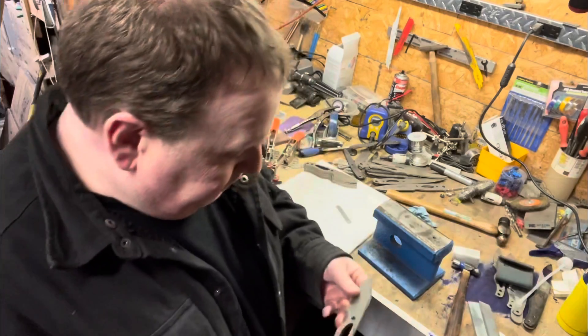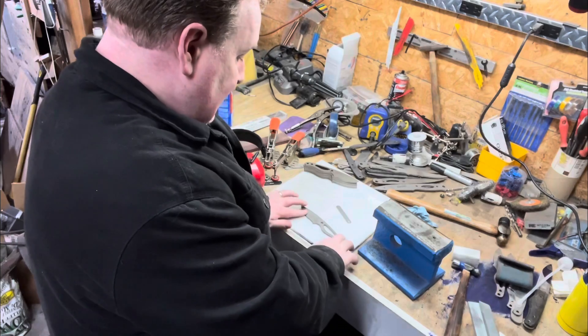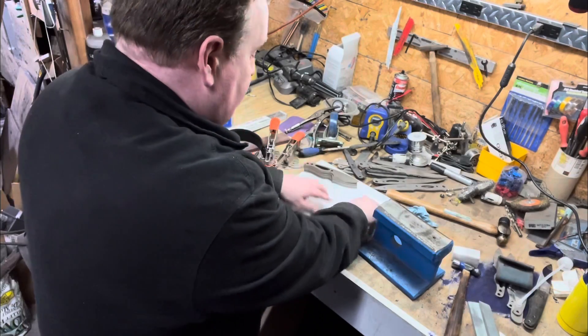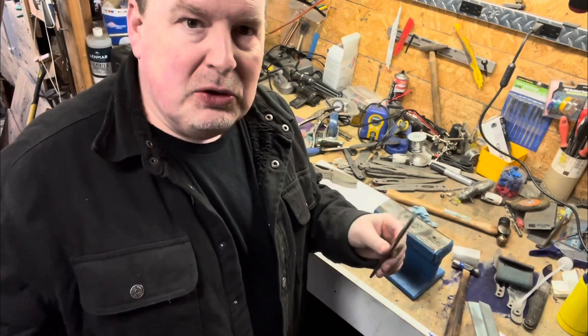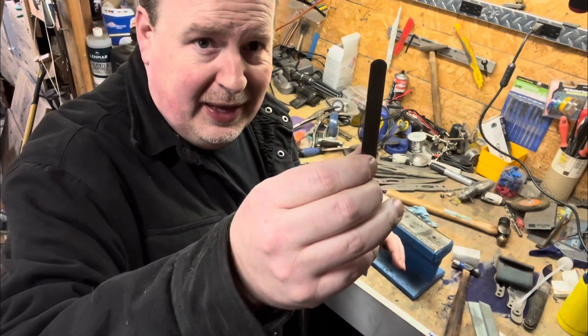Each one of those temper cycles is two hours and how many blades are you going to fit in your oven? Your wife's going to be like, why do you have 150 blades in my oven? You wouldn't even fit 150 blades in your oven. Anyway, here we have a warped blade. I picked one out that is twisted as well as warped. These are going to get ground — this is 140 thousandths stock, going to get ground down to 105. I want less than a 15 thousandths variation as far as warping. This is a 13 thousandths gauge.